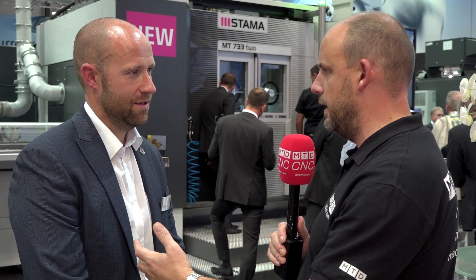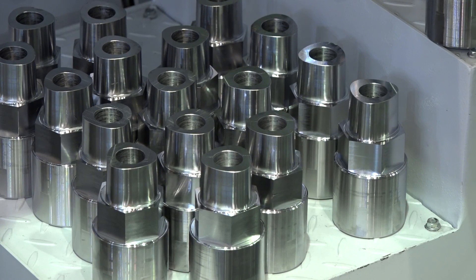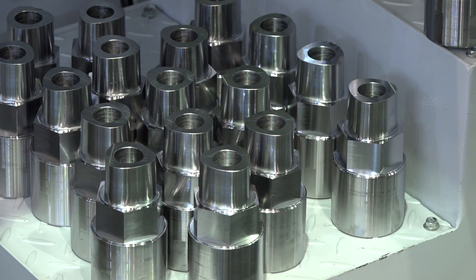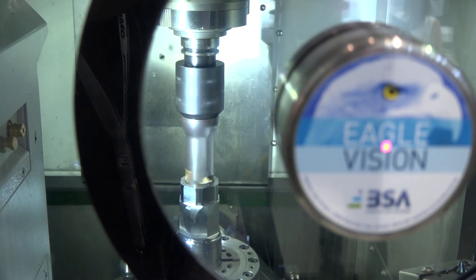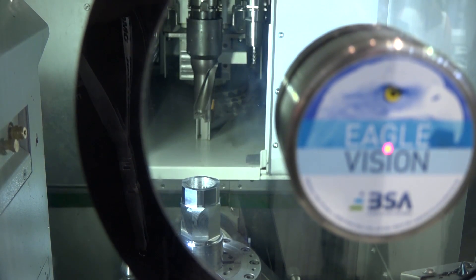When I say two 5-axis machines, I'm thinking imagine if you had a hundred off as an engineer — are we then saying we could do 50 off each side so you could half the cycle time? Yeah, it's literally two spindles, two tables in one machine. So 100% guaranteed any cycle time that you have is going to be halved.